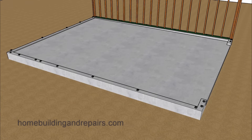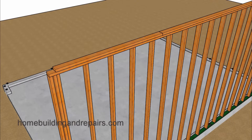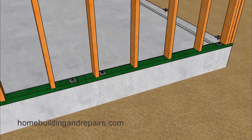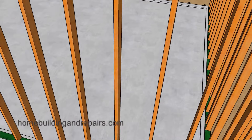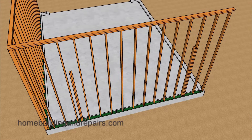Let's go ahead and put our first wall in. You can see where we have a couple of breaks in the lumber. For the top plates, the lumber cannot be shorter than four feet; otherwise you might need to strap them. On the bottom plates, you will need to put some anchor bolts in. You can see here where we have anchor bolts within 12 inches of each break — and that 12 inches applies to any break, including corners where there is a separation in the sill plates. The corners of the walls will overlap so you can attach them firmly together.